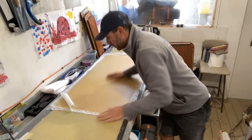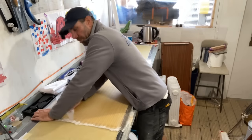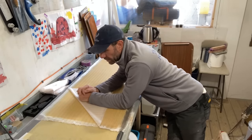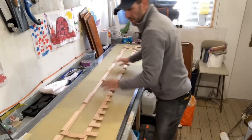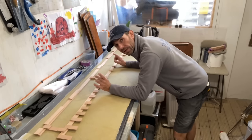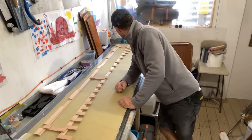I have my two sheets of fibreglass layup here. This peel ply rips off nice and easily — makes a lovely sound — giving me a nice surface to glue my strips of wood down onto. I've already removed the peel ply off the sheet underneath and I have my templates sitting on the floor. I'm going to draw around these, oversizing slightly, and then cut around it — cutting out the squares and triangles I also need for some other areas on the boat — and then I can start gluing up bits of wood.